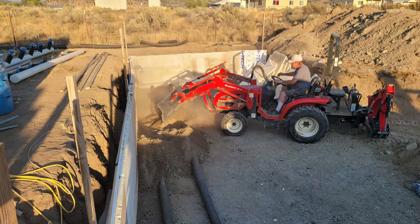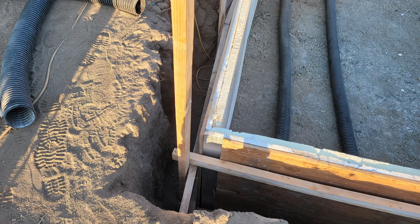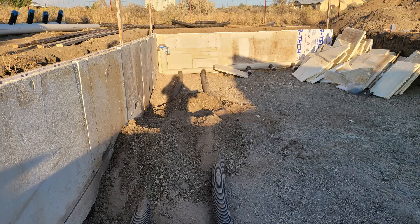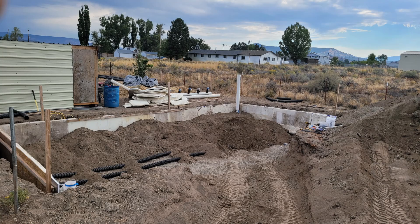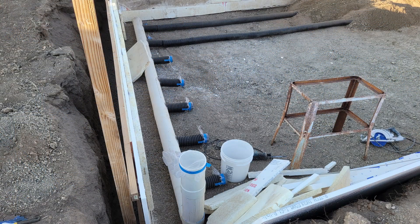After a couple more days of digging, we finally had a four-foot hole and started building the framework to hold the styrofoam insulation in place. We used two-by-three stakes about six feet long with two-by-threes attached between them, screwed plywood to the two-by-threes, and screwed two-inch styrofoam insulation to the plywood. Once we had walls built on three sides of the hole, we began laying the first layer of pipe. We laid the manifolds with the elbows at opposite ends of the hole and kitty-corner to each other, then installed the lengths of four-inch pipe between the manifolds using couplings. We attached two lengths of pipe and carefully covered them with dirt to keep them straight, also putting dirt on the outside of the walls evenly to keep the walls straight.